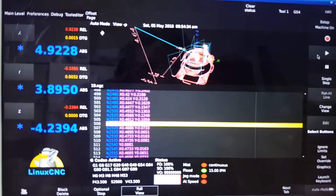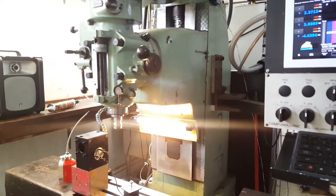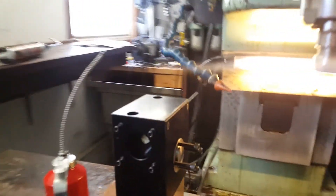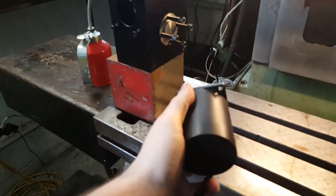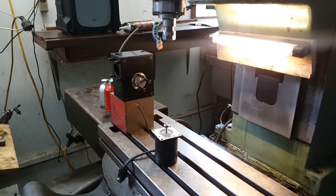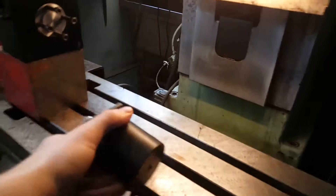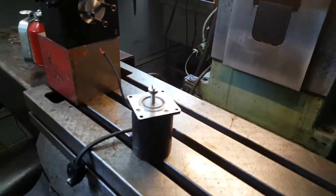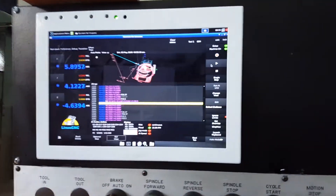We got it running, that's pretty good. I got this little guy for the A-axis, except it comes with this little motor and I don't have the driver for it right now, but I should be getting my hands on it pretty soon. I'm betting it's 24 volt being that small, and it's clearly brushless, so I can't use any of my current servo drivers on it.